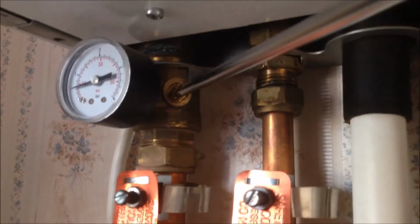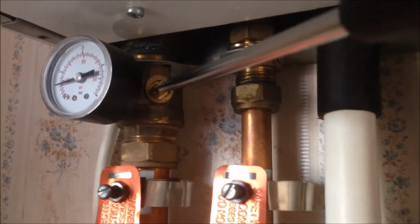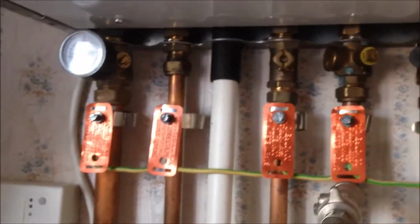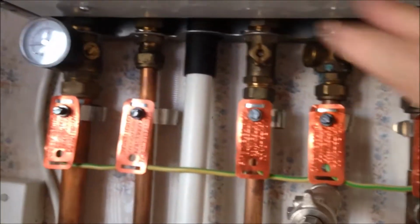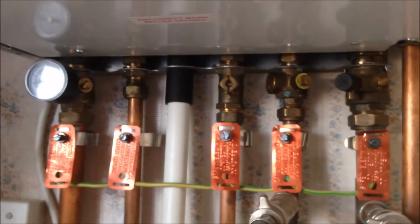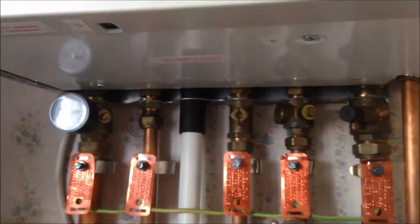And also this central heating water out valve, turn it clockwise as far as you can. So this is okay. Now we have switched off the central heating pipe out of the boiler and into the boiler, all switched off, so the water in the boiler will be kept, even when I cut the pipe to drain some water out of the system.